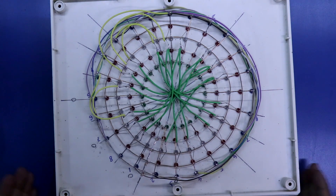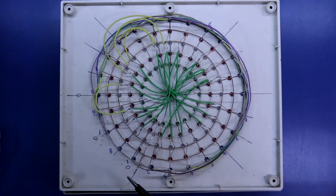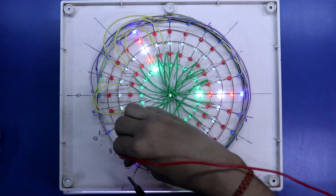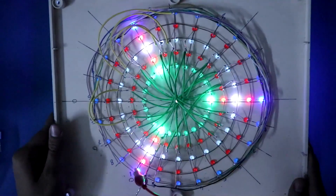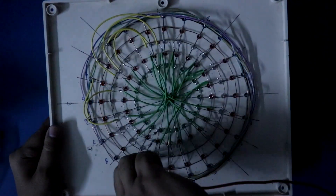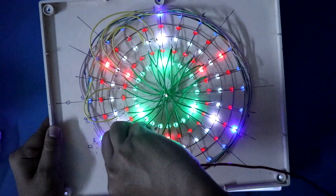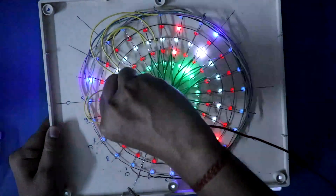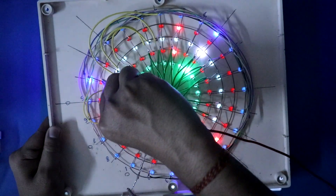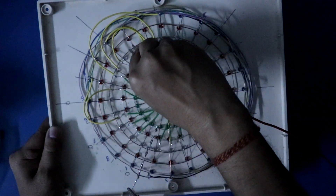Here you can see I have connected the resistors with the common negative pin of LEDs: 100 ohms with green, 220 ohms with red, then 100 ohms with white LED, then 220 ohms, then 100 ohms. I have connected the common negative, and from one to eight our positives, connecting to a 5 volt power supply. This is one, two, three, four, five, six, seven, eight, then again one.